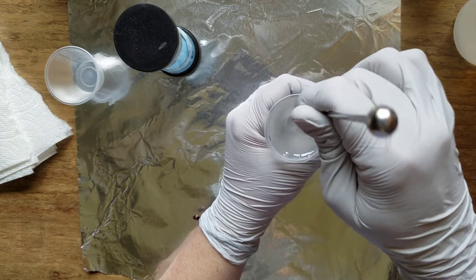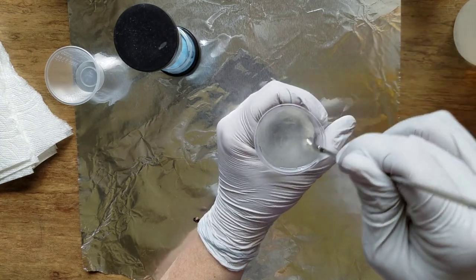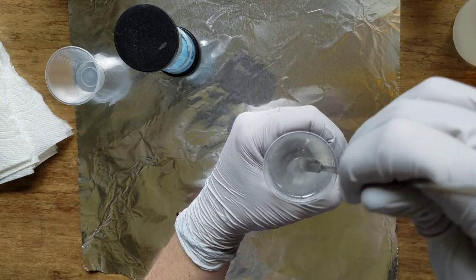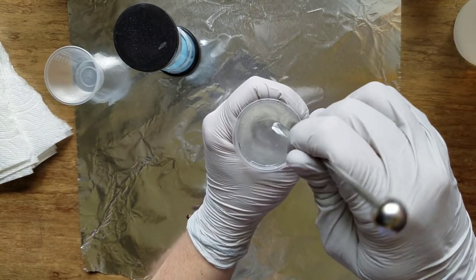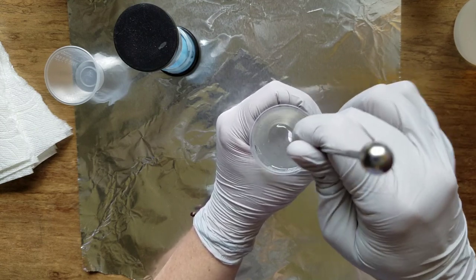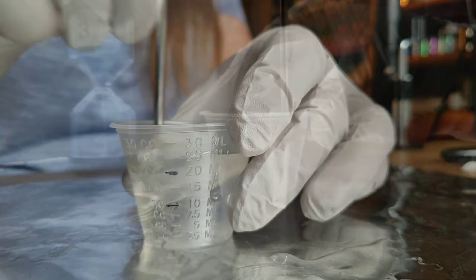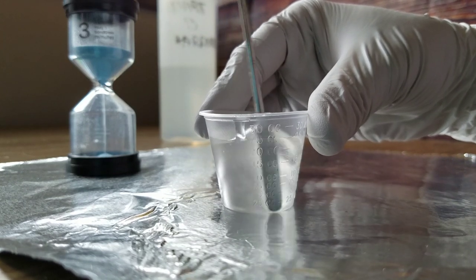That's a lot of times what happens when you have fish eyes — your epoxy could potentially not be mixed properly. See how cloudy it is here? You want to make sure you continue mixing until it is absolutely clear again. I go around and scrape the edges of the cup and scrape off my stir stick on and off throughout the mixing process so that I'm getting every part of both components incorporated properly. You also want to mix for the full time that your epoxy system recommends.